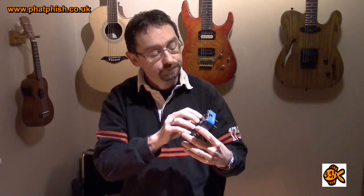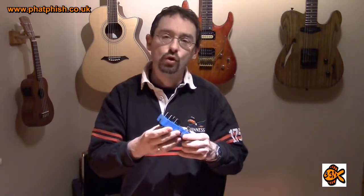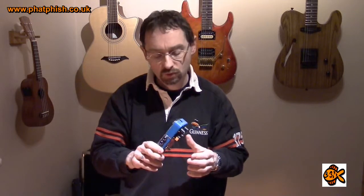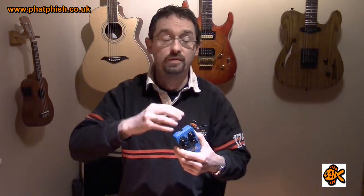The second little switch is what they call the dry kill switch. When that's engaged, the only output from the pedal is the effect itself — the dry signal doesn't come through. So when you strike a note on the guitar with dry kill engaged, you won't hear the note you play; all that comes out will be the delays generated by the pedal. This comes into its own in complex stereo setups where you only want the echo effect going to a particular channel. It's not for everybody but it's a nice option. These two switches are hidden behind the back panel — you'll set them to your personal preference, plunk the cover back on, and you're good to go.